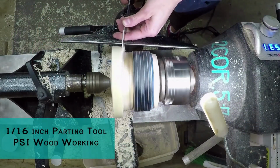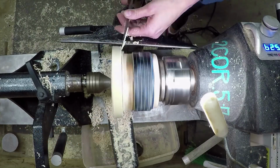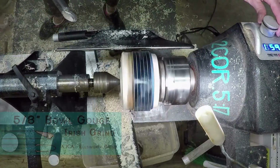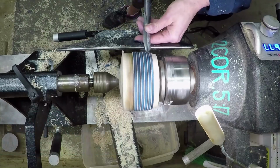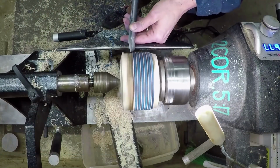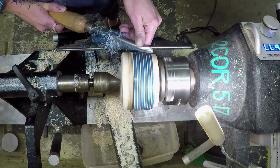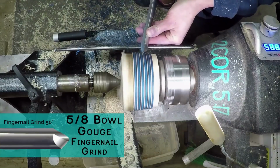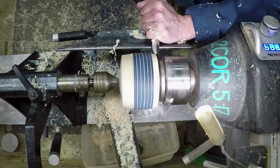I decided to seal the wood with CA glue. I used the medium because it gave me time to apply it without it drying so quickly. I did use about 3 or 4 coats on all sides of the piece. At the very, very bottom, I didn't put any because I wanted to remount it without that glue causing any kind of offset. So I just applied glue in the mortise that I created to hold the piece on later on.